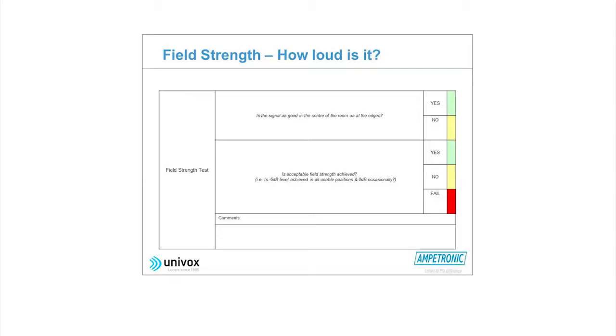Green, yellow, and no lights in one position. There are several LEDs there. Is the signal good enough in the center of the loop, as in the edge? You should look for that. That's an important thing to know, if the variation is a problem or not, and you could do that with the listener, with the LEDs on both of the listeners. You can find that out, and you can see if it fails or doesn't fail, if it complies or not. But I must stress, it's a simple test, but it's in many cases good enough to find out if it's working.